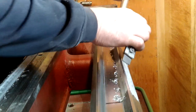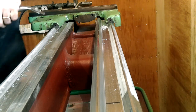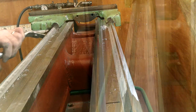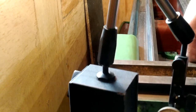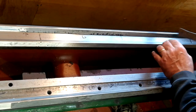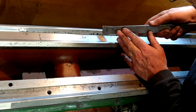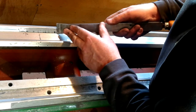It wasn't all plain sailing at this point because I had to be careful not to scrape too much off all four faces while confirming with the combined use of the straight edge, the V-block roller and micrometer, and the main saddle. The combination of all three measurement devices led finally to the saddle having a deviation as much as about 0.1 mm, which is about 4 thou. It's a lot better than the original 0.52 mm, which was 20 thou.